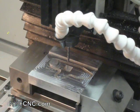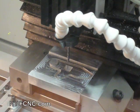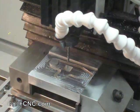All right, we're about ready to mill. I did want to let you know that I went ahead and reduced the depth of cut increments down to only 15 thousandths, simply because I want to be conservative with this bit since it's more expensive and because I've got about an inch to an inch and a half of the bit exposed below the collet, which will make the lateral forces quite weak. So here we go.